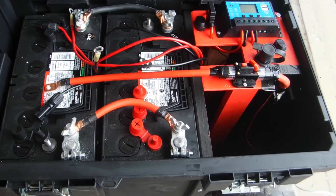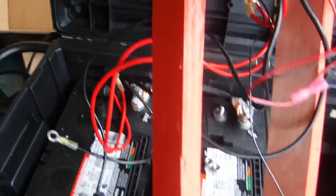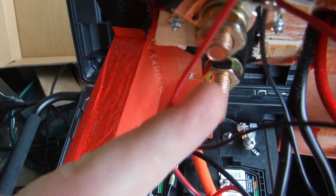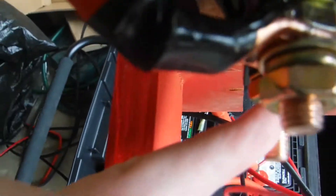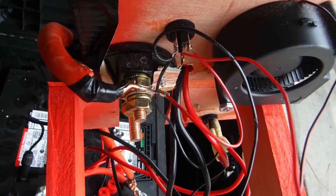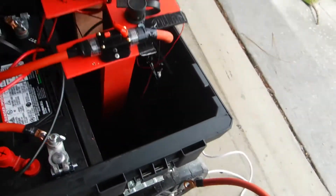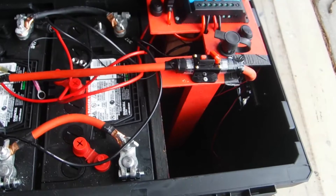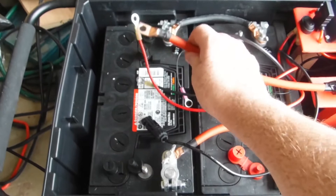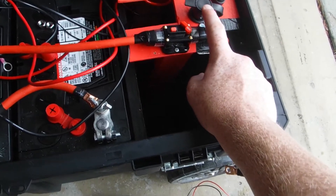Let me give a brief explanation of what I'm doing. Here's all the main wiring. The inverter will go down in this one right here. I have my outtake fan right there and an intake fan right there — those two will get wired in before I put it in. I have my main positive that goes into a breaker, but then goes into the main switch right here.